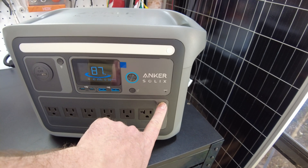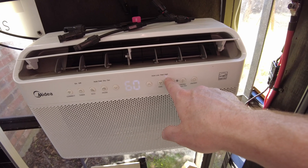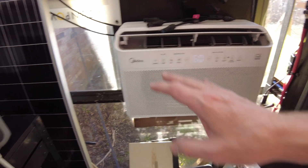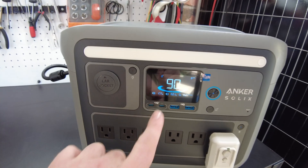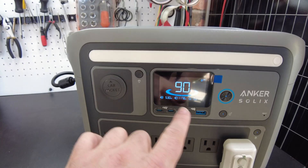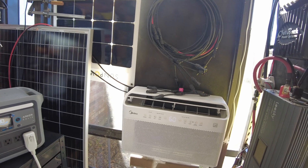While it's charging, let's go ahead and turn the AC inverter on and plug this air conditioner into it. It's coming on, it's on high, cool — just the fan right now. It might take a minute for the compressor to kick on. I'm finally hearing the compressor come on, everything is still working. So it looks like we've got 177 watts going out, and we've got over 1000 watts coming in. Let's pull the AC charging out so we're only running off the inverter — yeah, only 344 watts. So it's cranking that AC good.